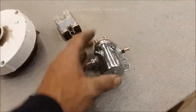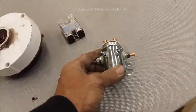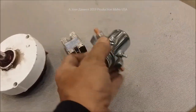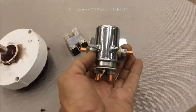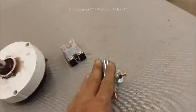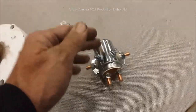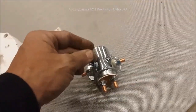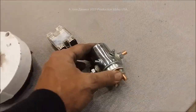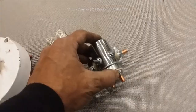They charged him for it. Because I have some of these — this is for a trolling motor. I've got a boat, and it's for a trolling motor or for RV batteries, like you want to bypass the RV batteries. This is not continuous duty. I don't care what someone tells you, this is not continuous duty. If you want a continuous duty solenoid like this, look below — I put a link.